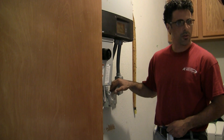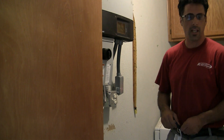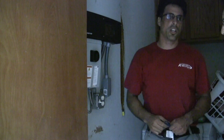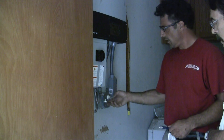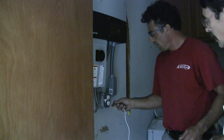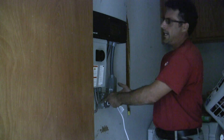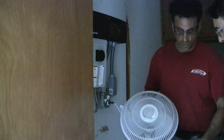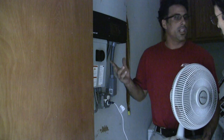I'm just going to demonstrate real quick how this works. If we shut off the whole house, mimicking a power outage — which I'll do right now. So I just shut off the main panel. What happens is, if I flip this switch, in about two minutes or so, this will actually give me power — without any battery backup, right from the solar panels. It takes about five minutes because the inverter has to read that everything's down, take that energy, convert it again, and then bring it down to this outlet.